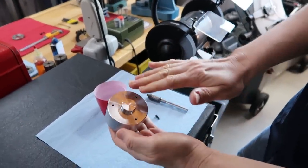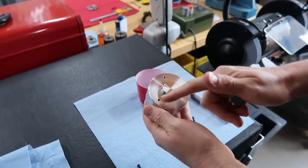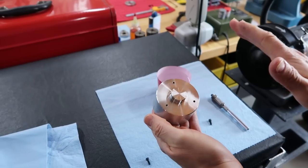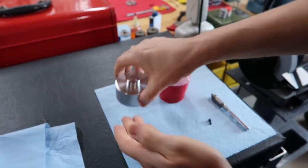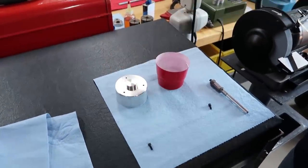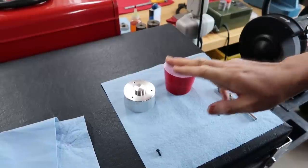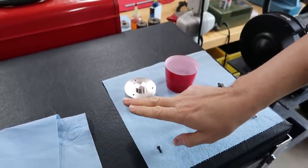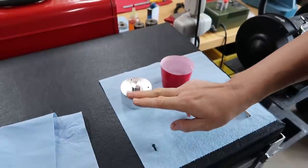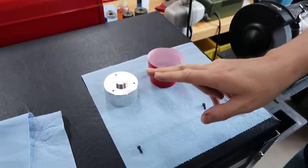Okay, this went really well. I used the transfer punch. I drilled the three holes, tapped them, went perfect. But the problem was when I went to mount the bearing cap, because remember, we have two operations we're going to be doing. We're going to do the operation where we clean up the front of the bearing cap by just doing a light surface cut. The cosmetic one. So we're going to do that first.